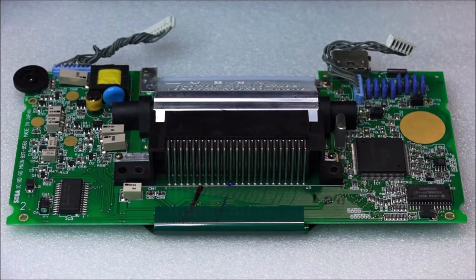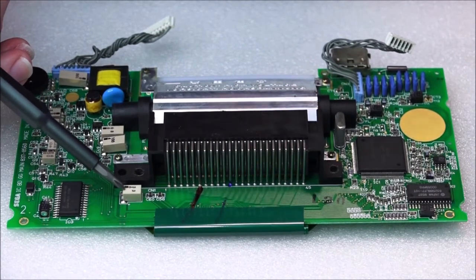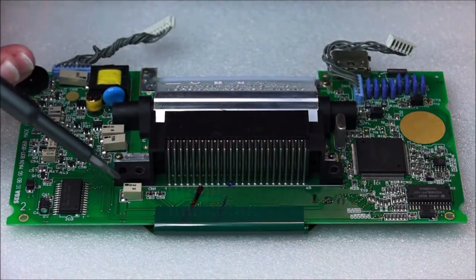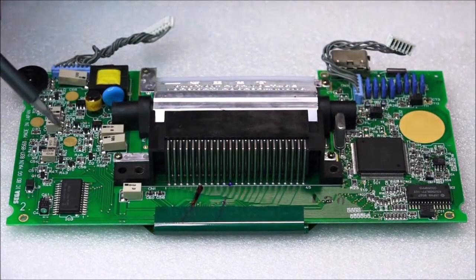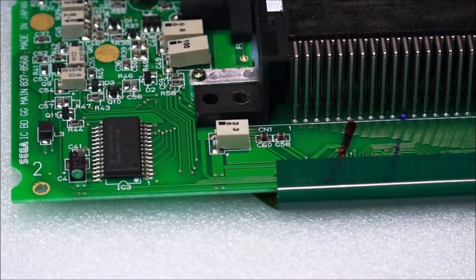Now we've looked at the capacitor list and the diagram, we're now going to look at starting at removing capacitors, and starting with this one here. This is C1, the 6.3 volts in the bottom middle left of the main motherboard. We'll just go ahead and zoom into that. Just get a nice little zoom in. Hopefully that can focus. There we go, lovely.